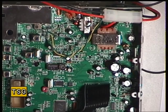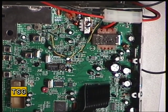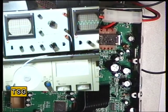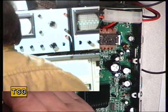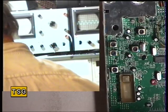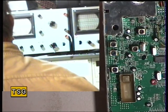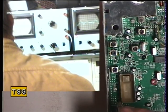We'll go for the deviation, and I'm sure that is RV301 — let's hope I'm not proved wrong. Getting my oscillator out — look at the right-hand oscilloscope, we've got 1.5 to 1.8 deviation. I believe RV301 is going to be deviation — and I'm right. That brings us up to two and a half. Just check that with the whistle test — it's just slightly over, just knock it back a fraction. That's it.